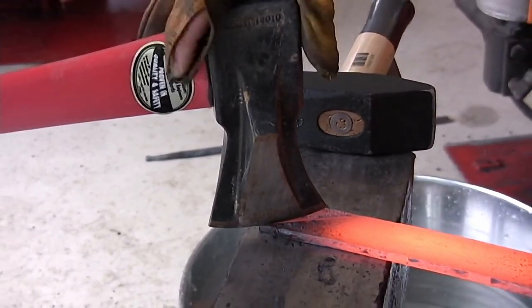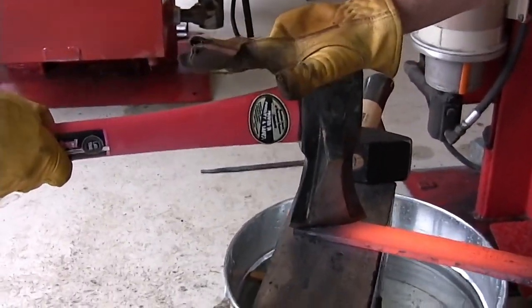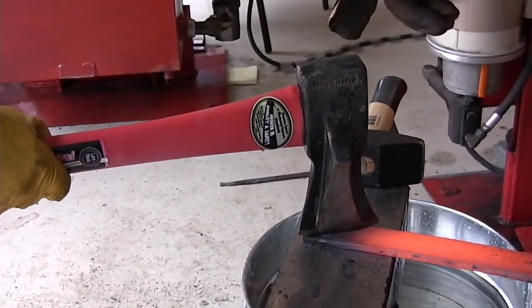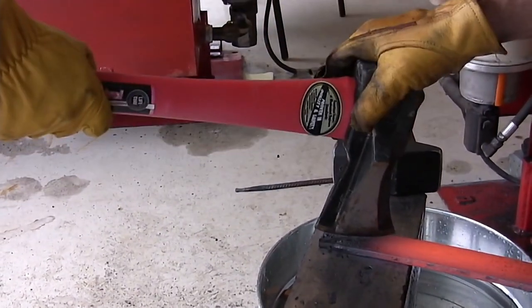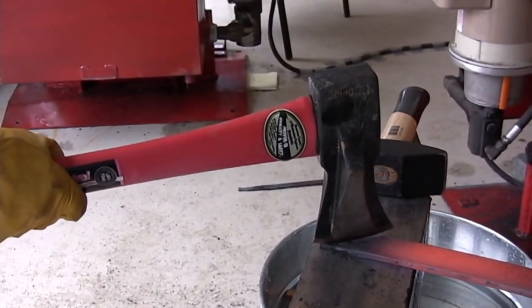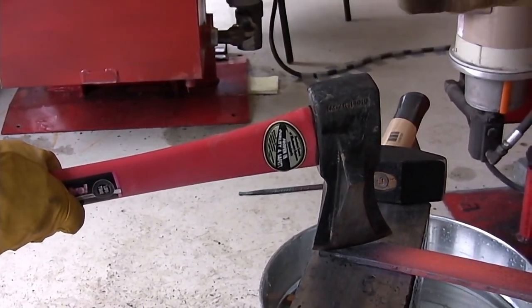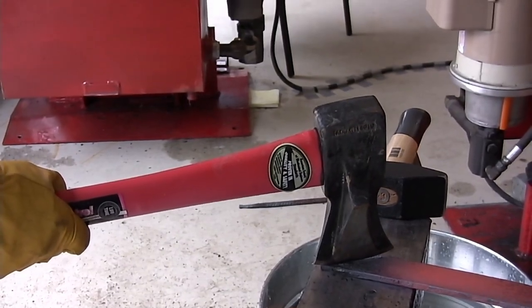Education. This is going to be awesome. So when you're doing a hot cut and you have the edge of surface, I'm going to strike over here. Now to move this back and forth, what you're going to do is lift the handle up and you're just going to be rocking the blade through the curve. Got it. So instead of moving it, you're just going to rock it forward and back, and that way it follows that first curve that we made. And it'll give us a nice straight cut. Okay.